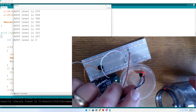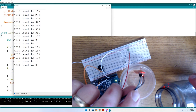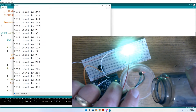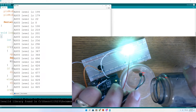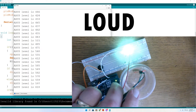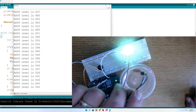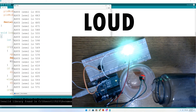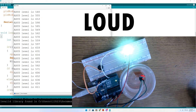The value is at zero now. The LED is on at 200. Adding a little more — now it's at 424, almost at 500. This is the sample code that came with the Elegoo kit, and the issue is the decreasing value as the sensor just sits in water. As long as it's over 600, the buzzer will go off.